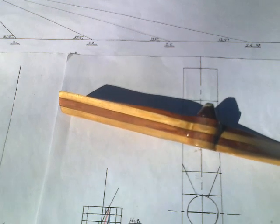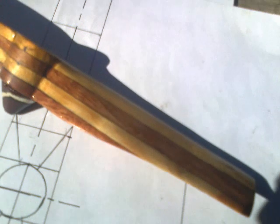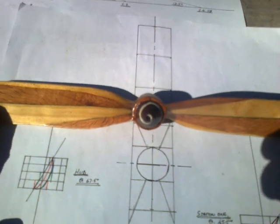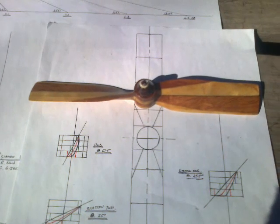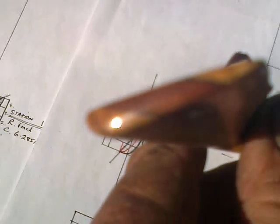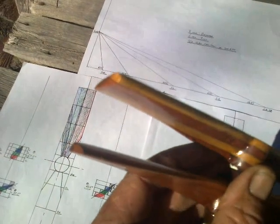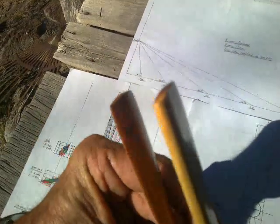This one, I managed to cure the incipient tip tracking error, which I had been building into it. However, that came at the cost of giving it a horrible hub wobble. So it probably does 170 cubic feet per minute. Mainly, I think, because this high lift aerofoil section designed by Irv Culver for a foot-launched hang glider produces a more turbulent downwash than does the Warbles on a lot TLAR, or 'that looks about right' aerofoil, which I sort of drew up off the top of my own head.